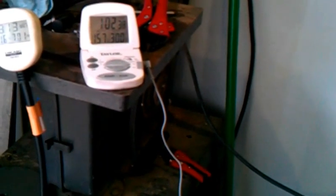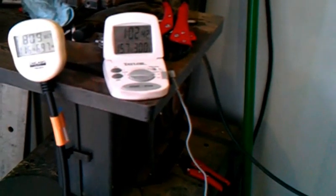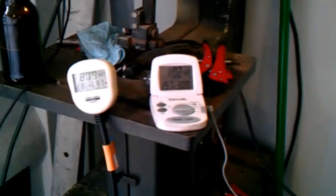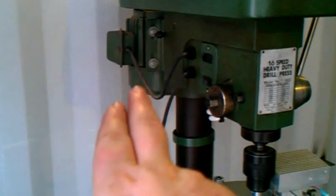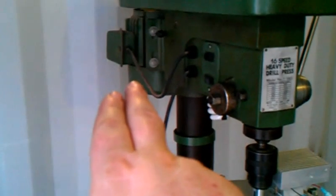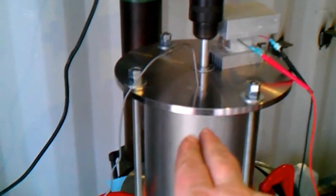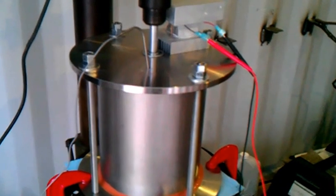Hopefully at that point we'll be able to not overload the motor and burn it out. The whole idea is trying to keep everything in balance on the entire system. You want your duty cycle on this motor to be 100% — able to run all the time. If you put too much strain on the motor, it burns it up. It's not a good thing — expensive mistake.